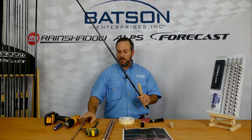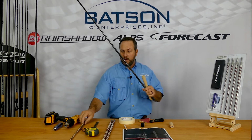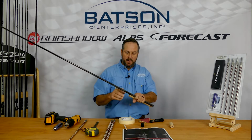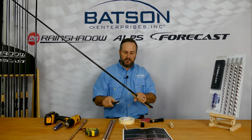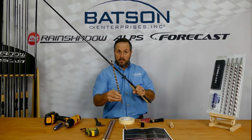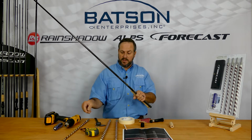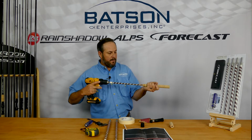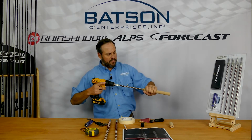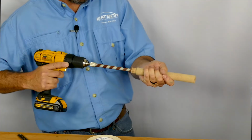We're going to start with the medium reamer. When you buy the kits, you can see the different sizes we have available. Knowing this is going to be about 13.5 millimeter, you can measure it if you want to. We know we're going to use all of this medium and definitely the large as well in this particular size. When you ream, you can go offset if you just go right through because it's not self-centering. So I like to let it spin in my hand when I go.